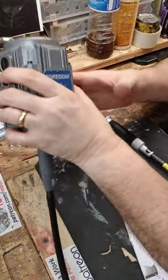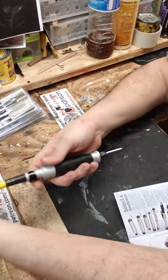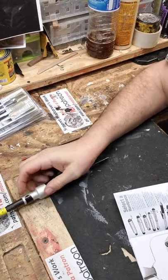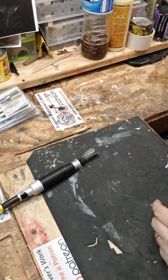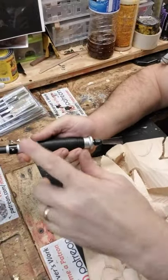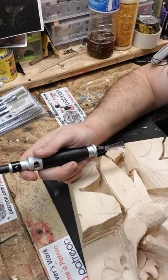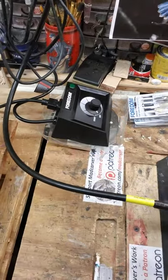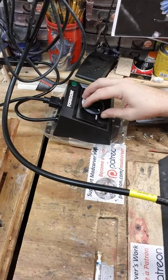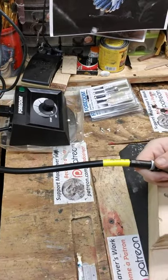Let me give you an example of how this thing works. You've got to hang it — try to position it in a way that allows you to use the flex shaft without kinking or bending it. For the torque required, they recommend using the selector here instead of the pedal, because this gives you more control over how much speed is being used.